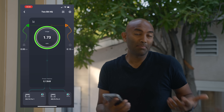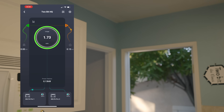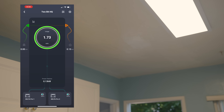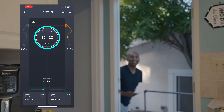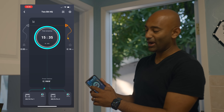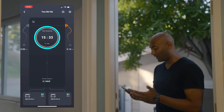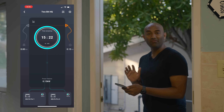Now the moment of truth — let's simulate a power outage. The lights are on, everything's on and connected to the grid. I'm going to go turn off that entire service panel. Do you notice anything? Anything flickering? So now, if you look at the app, the green arrow representing the grid is turned off, which means we are powering off of the EcoFlow batteries. Currently, both batteries are about 50% charge.